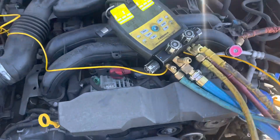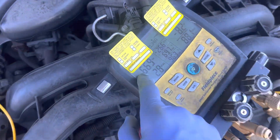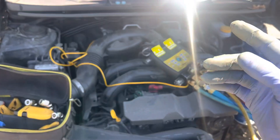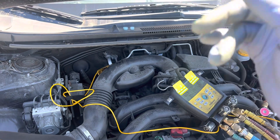Look at our superheat for this particular vehicle. That is definitely no bueno, dude. That's not flying very well there, and we got no heat. I don't have my laptop on or my PDA to show you the temperature. Basically, it's ambient air temperature coming out of the dash.